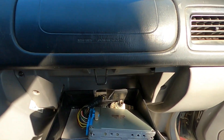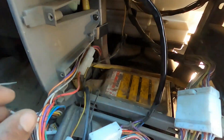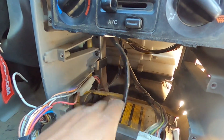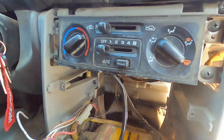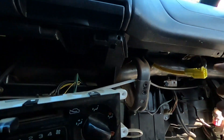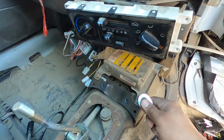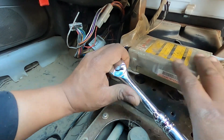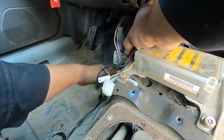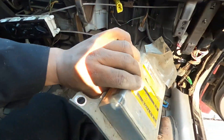I'm gonna try and remove all this to get all the airbag stuff out. So I took off the radio surround, the radio, and the shifter surround so I can get to this little bad boy right here — that's the airbag control unit, and that guy has to go. Once we take this out, there won't be any power going to either of the two airbags in the car. I already removed the wiring that ran underneath the fender on this side, and this is the wiring that goes to the actual airbag on the dash. And just like that, no more airbag system.